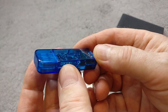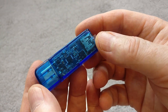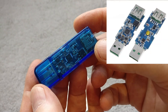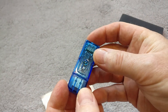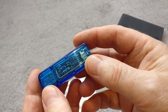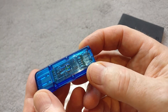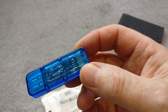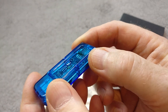Fortunately, the controller for this device is an ESP8285 chip, so we can probably flash Tasmota firmware or something similar to it and control it locally. Apparently this can handle devices between 3.5 and 20V and take up to 5A, which is more than enough for most applications.